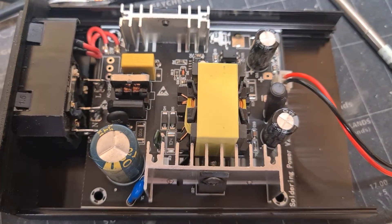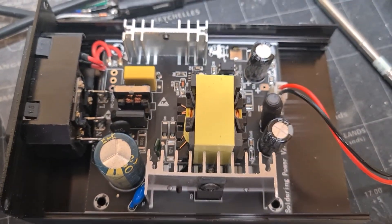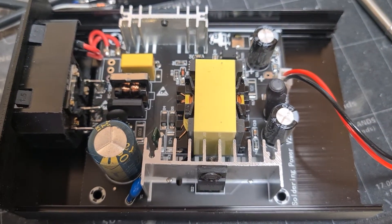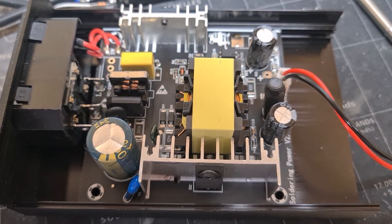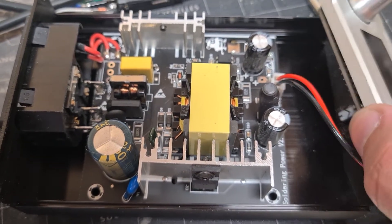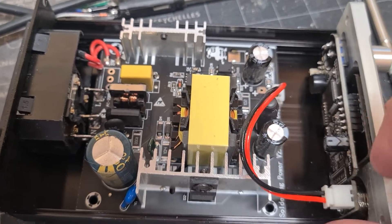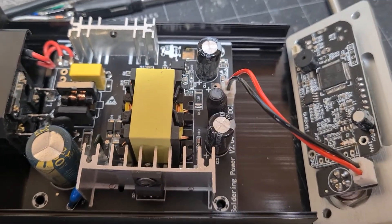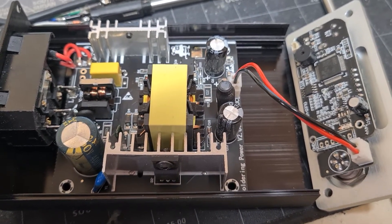It's been absolutely fine up until recently when the cable shorted and just popped that FET. There was quite a bit of current behind it, judging from the cracker it made when it failed. Before that you just got 'ERROR' in big letters and I think it said 'B1' in the top left corner. Without that FET it just reads the temperature all the time and obviously doesn't heat up. So replacing that FET with a P-channel one — either identical or similar — would get it going again. I quickly tacked something on here and that's restored it to life.